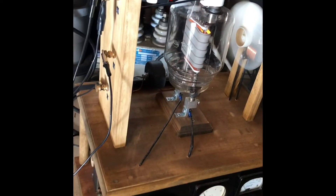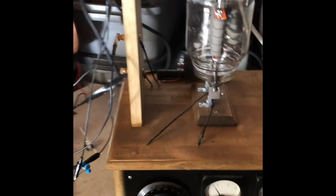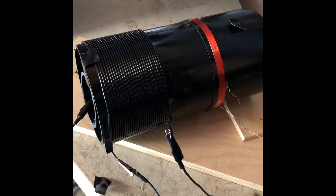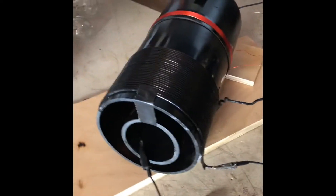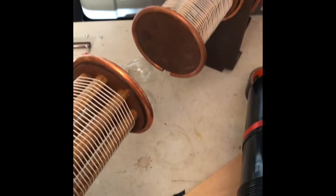This is the setup: we have a single 833A2 here with the fan going and the filament at low power right now. This is all extremely crude, but here is the power coil which raises the potential to a significant magnitude, and then we have the tank capacitor there, and of course this transformer coil is neither an impedance match nor a frequency match to this combined set of extra coils.